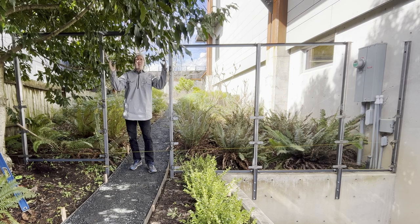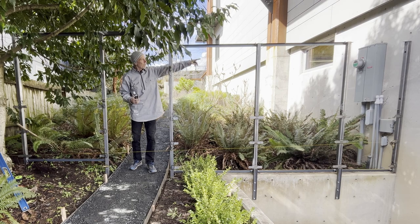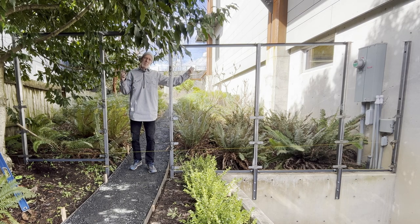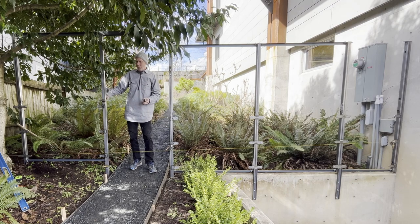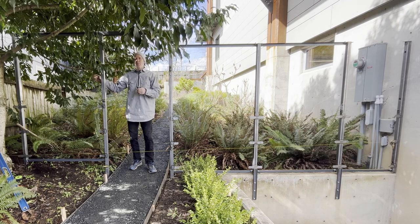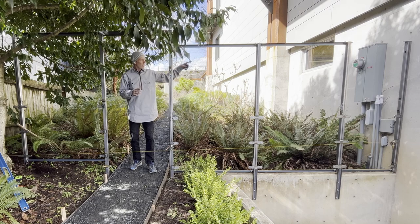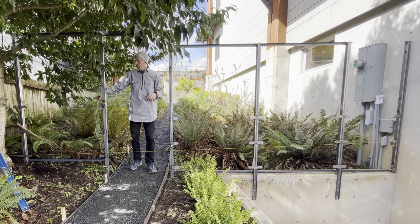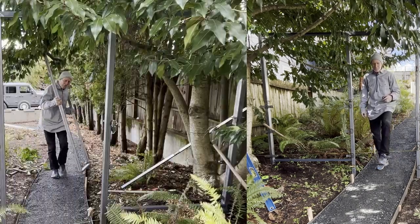make sure that, I don't know if you remember, this thing needs to probably rack a little bit to get the things to line up real well. And I can use the final leg of the top rail over against the wall to actually pin or move that and then lock it in place. I want to do that before I pour the concrete so that I'm not messing with that while the concrete is curing and perhaps messing up the concrete. So I'll get this thing stabilized, get this door racking and completely adjusted, then I'll go ahead and put the concrete in just after that.